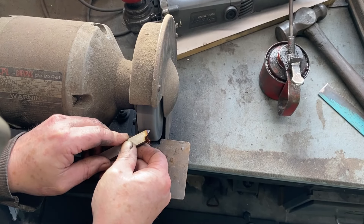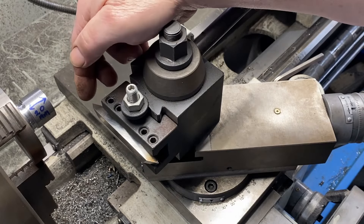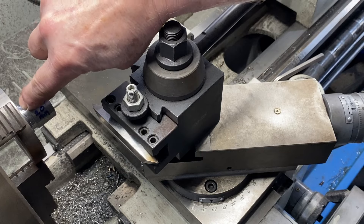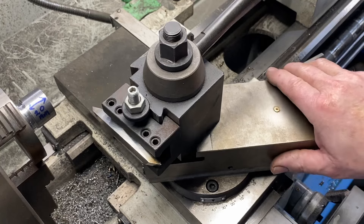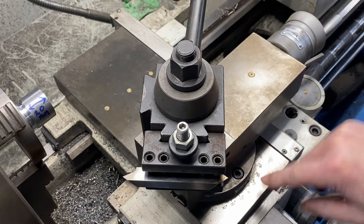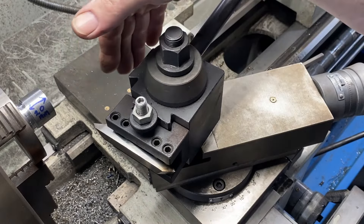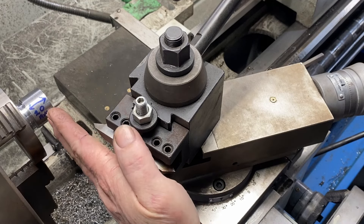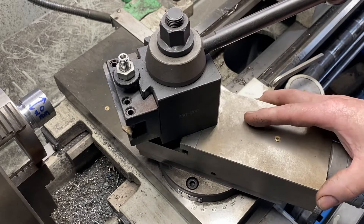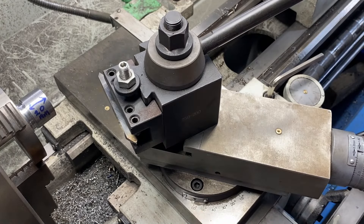First I have to grind up a threading tool. This is 60 degrees and I've biased it to the left of the tool because I'm threading up to a shoulder. The freshly ground tool is in the tool holder and I've cut the recess so the tool can go into that when threading and I can stop the lathe before it goes into the end of the part. For threading I want to set the compound slide to 30 degrees. There is a little problem with my lathe's scale — if I set it to zero I'm parallel with the spindle, and if I come around to 30 degrees I'm 30 degrees off parallel, which is not what we want for threading. We want to be 30 degrees off perpendicular to our work, so I need to turn this to perpendicular and then come back 30 degrees, which is actually 60 indicated.